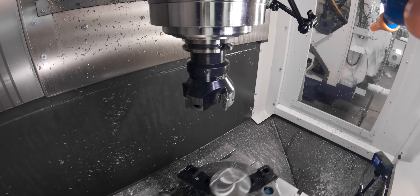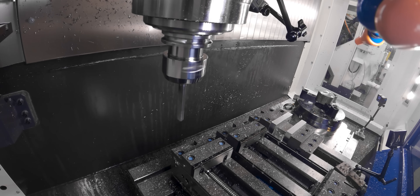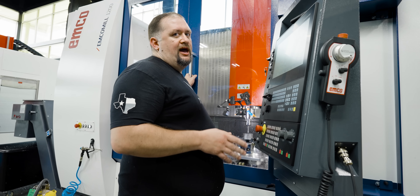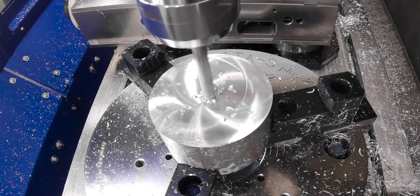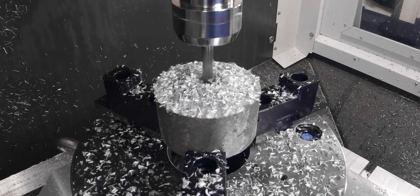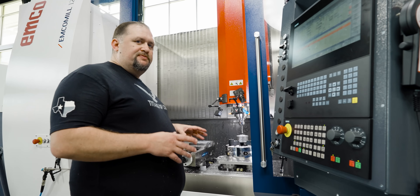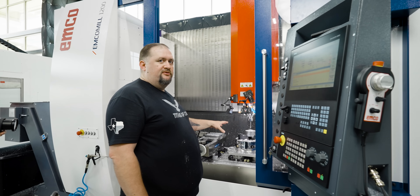This is the tool I'm really concerned about because we don't have through-air on this machine and we're running dry, so the chips are going to have to get out of the hole on their own. If they don't, it could create enough friction to actually ignite our piece of magnesium. We got lucky. When running magnesium, one thing you want to be very careful of — especially in this situation — is letting chips pile up. Piles of chips are potential fire hazards.